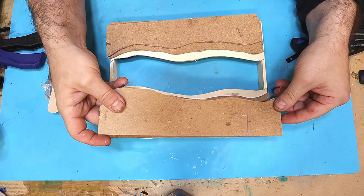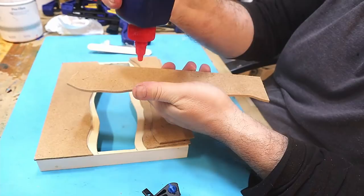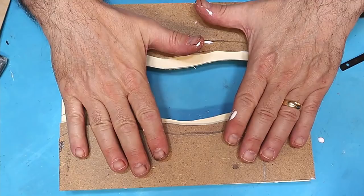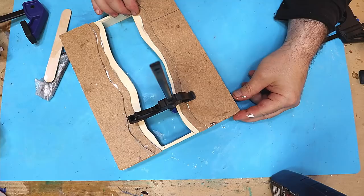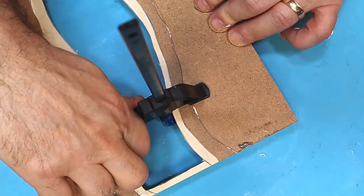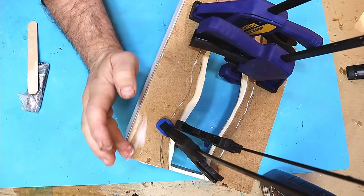If I've got a little bit of overhang I'm not too worried — I can always sand that off — but I'd rather keep it as neat as possible to start with. I'm lining these up now to pop some clamps on. If you haven't got any clamps, just put a heavy weight on there, a couple of books or something similar. If you spend a bit of time levelling these all up, that's less sanding you've got to do when it's glued together.